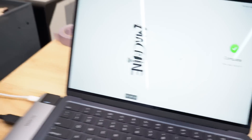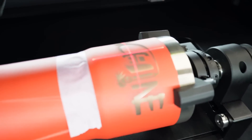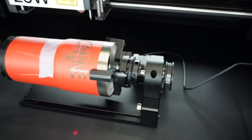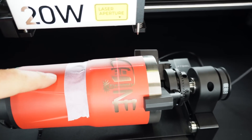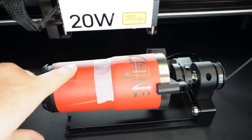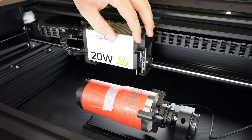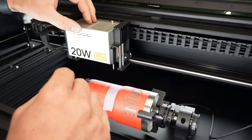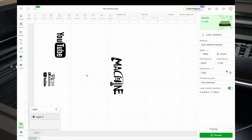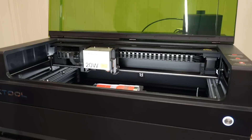The program is complete. That looks pretty good — there's a little haze on there but that's okay, we'll clean it off. I'm going to leave everything in place because I want to do one more engraving with the Spicer Designs logo and a small YouTube logo underneath toward the bottom. The cup offsets down a little there, so we need to move the laser down, keep it on our center mark, and pull another measurement using the probe.